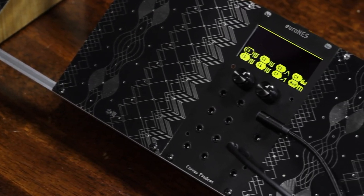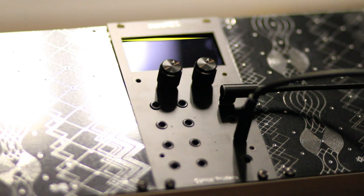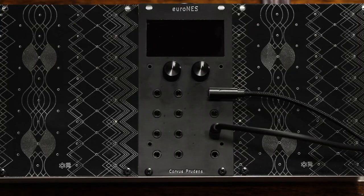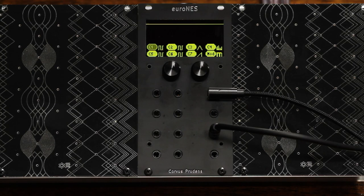The software of the Euronest translates musical commands through MIDI or CV to the format that the NES chip can understand. The module can interpret five different modulation signals in addition to note on and note off, including pitch bend, vibrato, expression, pulse width, and portamento. These are what I consider the essential elements of chiptune musicality. There are a few quirks per channel — for example, the triangle channel only has one volume, so the expression input will do nothing until it hits zero, where it acts as a note off message.